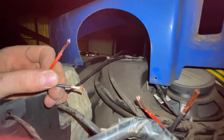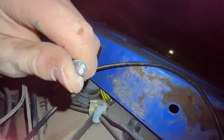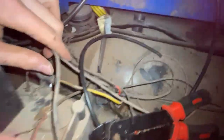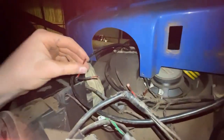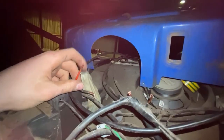So I'm cutting into my beacon wire now. I'm stood precariously again on the back of the tractor. As you can see, it comes out the bottom of the plug there. Cut into it, and then my other wire for my strobes is this one here. I just need to strip the ends - I've got four-core cable but I only need to use two of the cores for this one, so I'll use red and brown. There's been someone doing quite nice wiring in the back here - there's plugs and everything. I think this has been added at some point because it's got a different plug on this side. I think it's only been a one-beacon tractor and they've added one on. I'll do this off camera because it's hard hanging on to the back of a tractor while trying to screw stuff together in the dark.